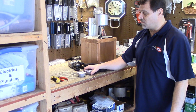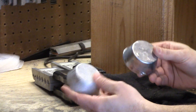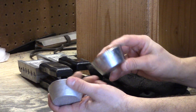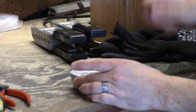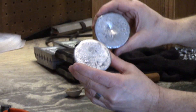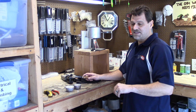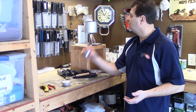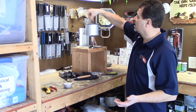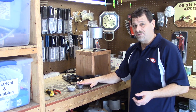When I melt my lead down I get it from different sources. These are visibly different - this one's soft, this one is wheel weight lead. I can tell by pounding on them; I hear a difference and you can just see the size of the dents is different. When I pour I use a mixture of soft and hard lead - two to one. I melt everything down using a cupcake tin and pour them into about two pound pucks. They fit in the pot really well.